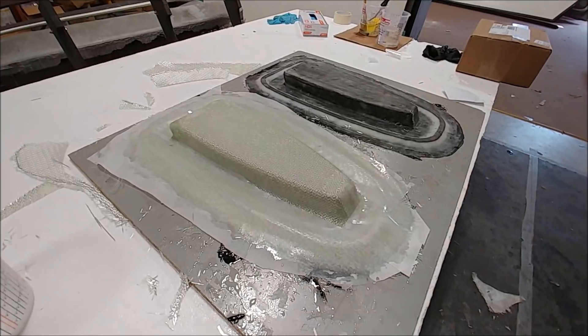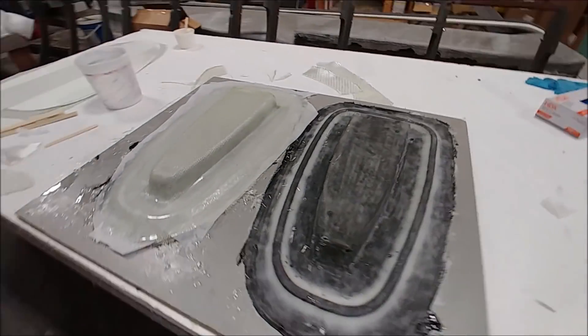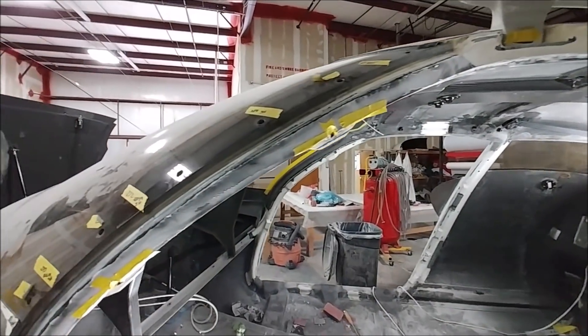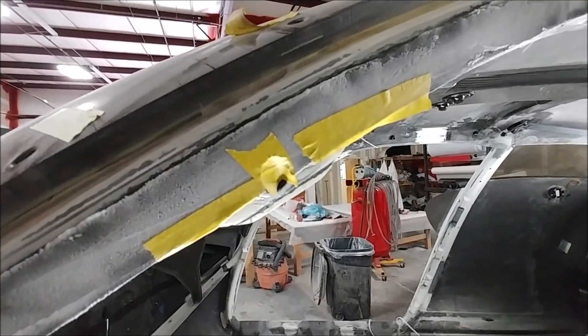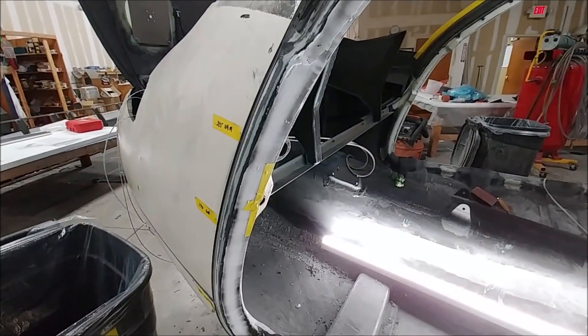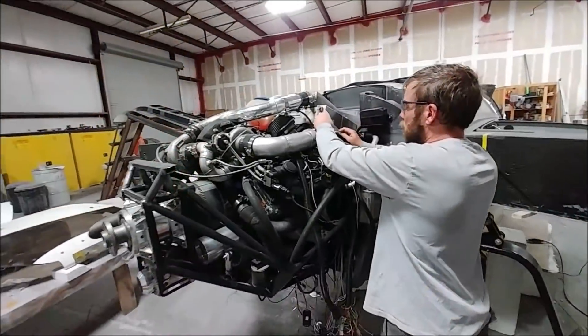Devon is doing the heavyweight layers on each of these molds — he's just done the first one and the second one will come. I've moved on to the left-hand side, clearing out where I did those layups around the pin sleeves and making sure the door shuts nicely and the gap clearance is just right for that seal, so that's going to work out well.